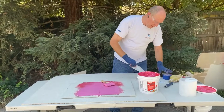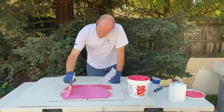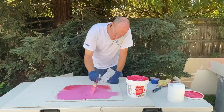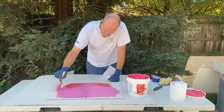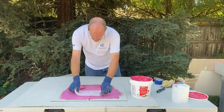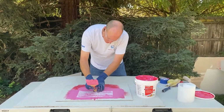So if we're fabric reinforcing over our seams, the best practice whenever we have these types of joints in our concrete, saw cuts, cold joints, expansion joints, is to honor them. How do we honor them? We put our fabric in just like I showed before, but one little catch. We're going to come back through here.